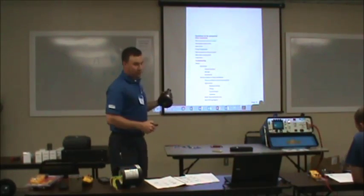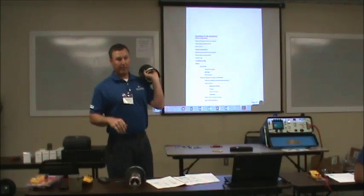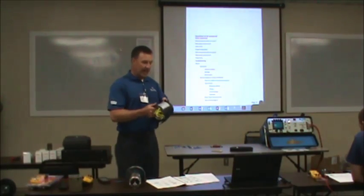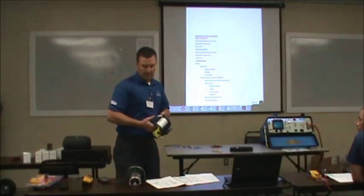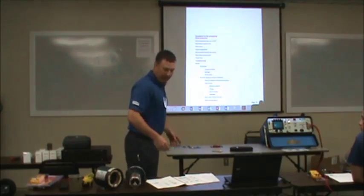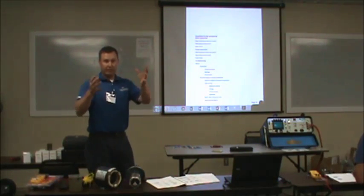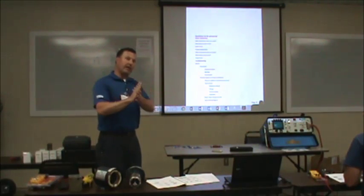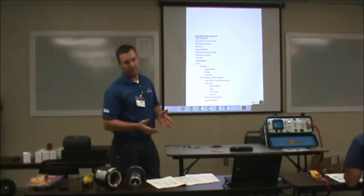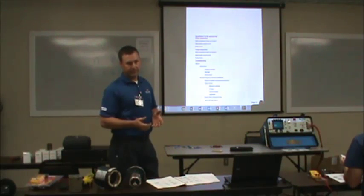Let's talk about the physical condition. You take this motor right here and cover it up with a piece of insulation, and while it's running, it's going to get hot. It's designed to dissipate the heat away from it. So for physical conditions, make sure that everything's cooling. Totally enclosed fan-cooled motor, I'm sure you've seen it. We saw it in the diagram of the AC motor, or even the single-phase motor. It's got a fan on the back, and most of you have seen these. The fan shroud has vents on it. If you ever get them too close to something where it can't draw air, then you're cutting your airflow down. You're cutting your motor's cooling capability down. When you do that, you're shortening the life of your motor. So make sure that it gets plenty of air. It can get stopped up.